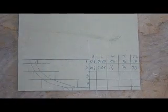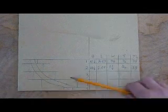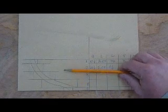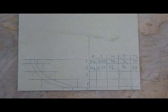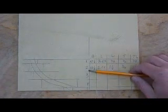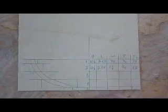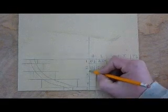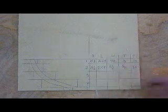Okay, so now I'm going to tell you how I got to the point of laying these out. Once you've established the thickness that you want each layer to be, and in my case it's going to be 3/4 because I'm going to start with rough sawn stock and plane it down myself, you're going to measure up. I go back to the center line and do it. Starting with my first layer, which is going to be about 3/8, I'll make a line, and then come up 3/4, 3/4, 3/4, and then finally another 3/8 for my top one.